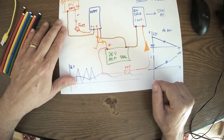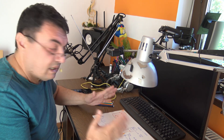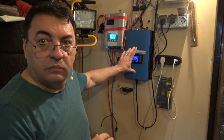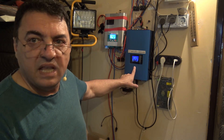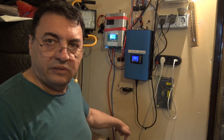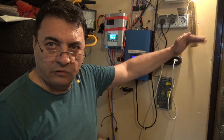If you can have an energy buffer — a battery buffer — it doesn't matter if it's not exactly the right power rating or in perfect condition. It's enough to level things out. Even these batteries can supply maybe 500 watts, but that's enough to smooth production. Here's the scenario: the inverter is capable of 900 watts and is currently delivering half its maximum. The rest of the power charges the batteries. If the sun goes behind a cloud for even a minute, the batteries keep supplying the inverter with the same energy. Instead of sharp spikes and drops like before, the output is almost flat — and that makes a huge difference.